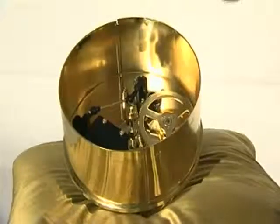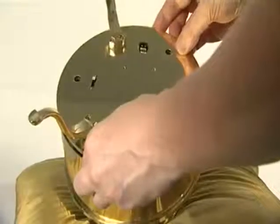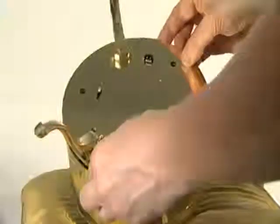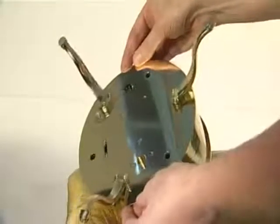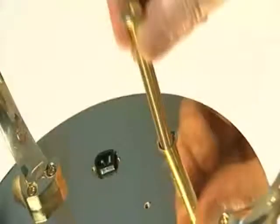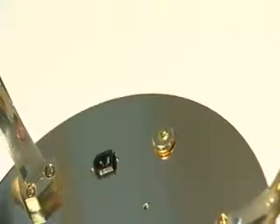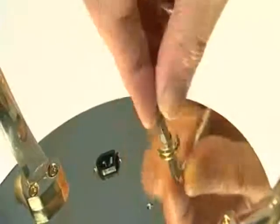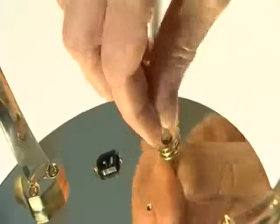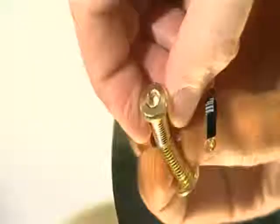Lay the bottom plate with the motor, control system and legs over the drum sides, ensuring the sides fit in the channel around the outer edge of the bottom plate. Rotate the bottom plate gently until the drive shaft engages with the jaws of the motor spindle. When the three bolt holes align with the sockets in the underside of the engraved plate, lower one bolt at a time through the bottom plate and engage its thread. Tighten with a 5mm Allen key, then repeat for the other two bolts.